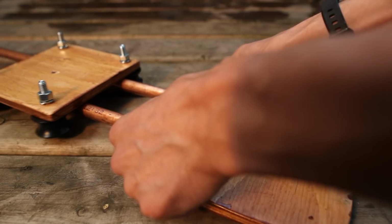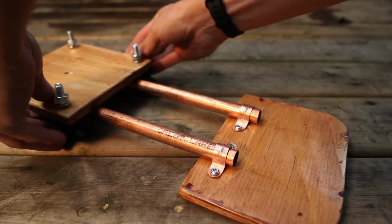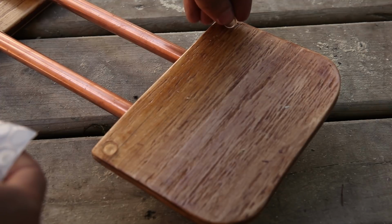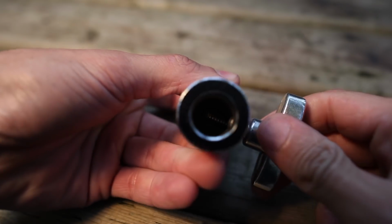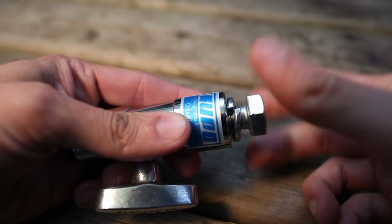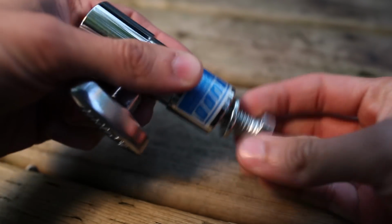Once again, properly measure the distance between rails so that they are even with the other side. I've also purchased some clear stick-on spacers, which we're going to attach to the bottom of our end pieces. If you'd like to take it a step farther and have the ability to mount your slider to a couple of C-stands or lighting stands, you can purchase a couple of TVMP adapters for about $11 a piece. I've put a link for these adapters in the description of this video as well.